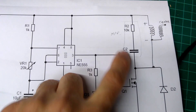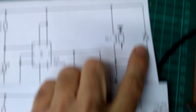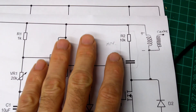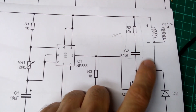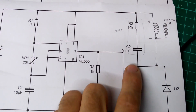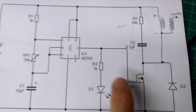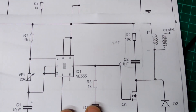I've also added a resistor and capacitor as a high-pass filter. Previously the diode in parallel with the primary coil would limit the voltage spike developed when the MOSFET switch turned off — but we don't want to limit it so much this time; we actually want it to increase. So rather than a diode in parallel with the primary I'm using this high-pass filter, which will at least provide some protection to the rest of the circuit without fully clamping the elevated voltage on the primary.